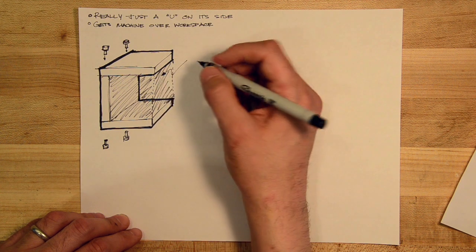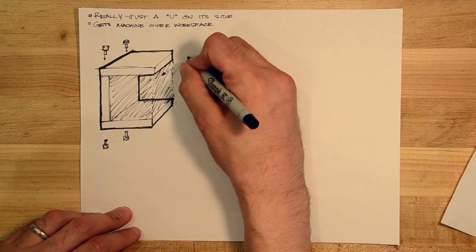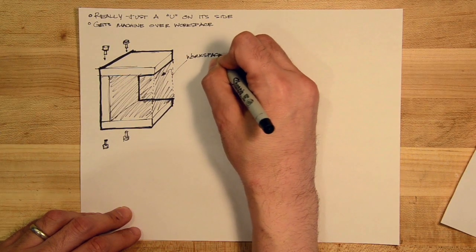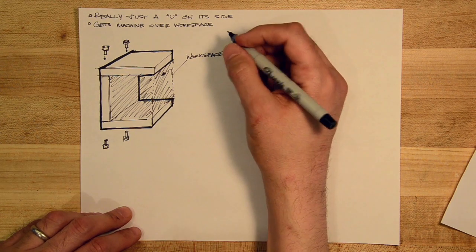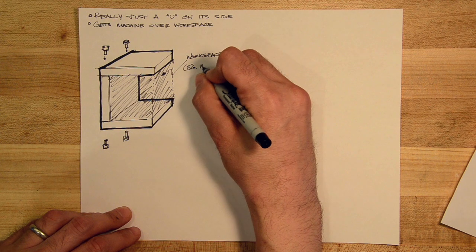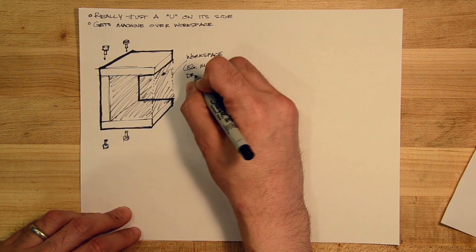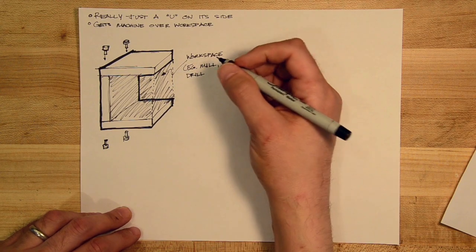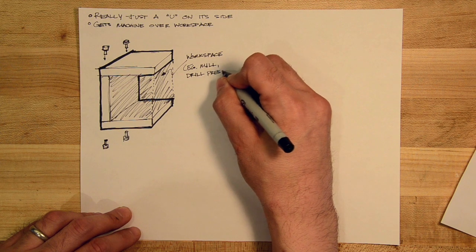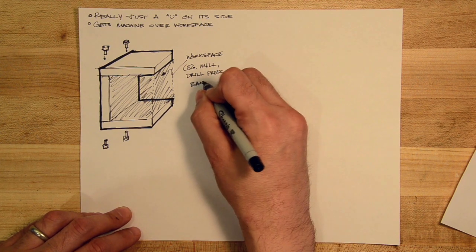And if you've spent any time around machines, then this structure should probably look pretty familiar to you. So this C shape is used for a variety of machines, and some examples of those machines might be sort of the standard knee mill, or the mill that you see in a metalworking shop. Maybe a drill press, so you might have a motor or some belts and pulleys up top and a chuck that's sort of suspended from the top base plate. Or maybe something like a bandsaw.